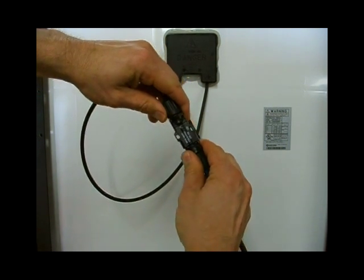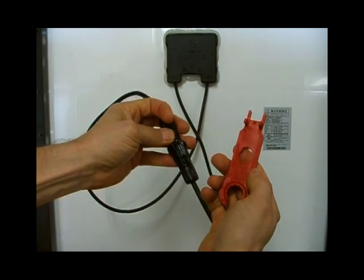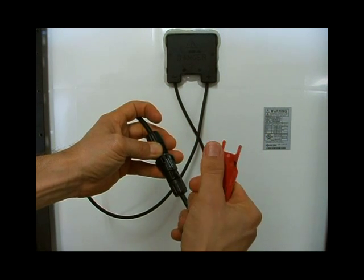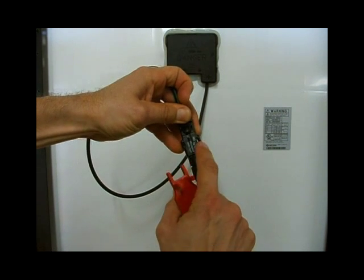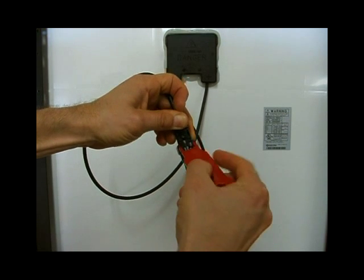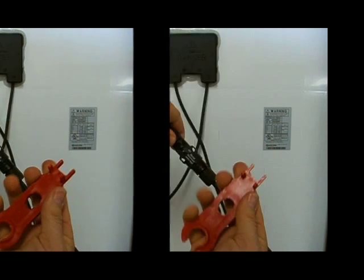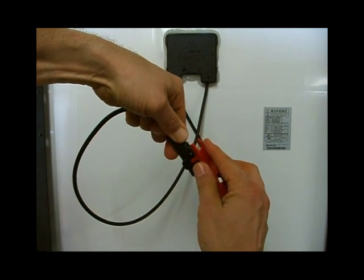A special unlocking tool is needed. The small plastic tool serves other functions as well, but it has two pairs of prongs, either of which can be used as keys to unlock the connectors. Insert the prongs through the holes in the sleeve, where they'll push aside the bumps on the locking tabs, allowing release of the connection. Both pairs of prongs do the same thing. The choice of which ones to use is up to you.